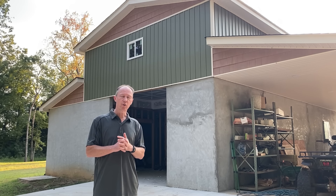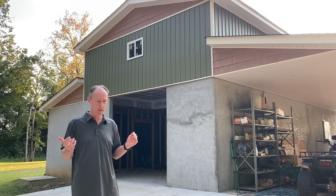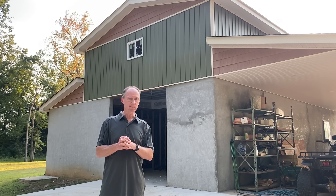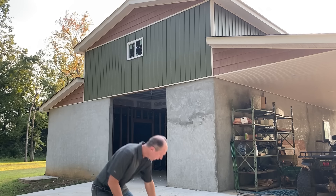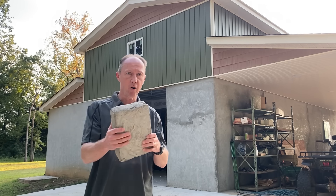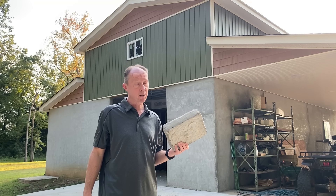The other thing I wanted to try to do was reduce the cost of just pure Portland cement and foam for the AirCrete. That's not super expensive, but I wanted to see if I could do better. But everything that I added to the mix either made it more expensive or it didn't help the mix. I came close with builder sand and AirCrete. I got a real nice hard block out of this in my workshop, but it is not nearly as insulated because it's so heavy.